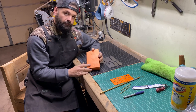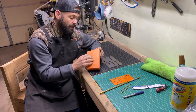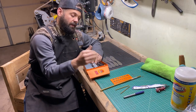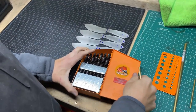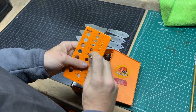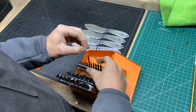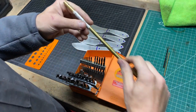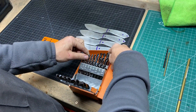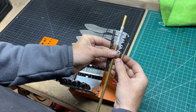These drill bits were designed for heavy metal — steel, stainless steel, grade-eight bolts. Combined with a Drill Doctor drill bit sharpener, this is my key to success with drilling through these knife blanks. I'm going to pick out the appropriate sizes: 11/64ths for the pins — 5/32nds would be too small — and 5/16ths for the brass lanyard tube. Those are the two drill bits I need for my initial drills.